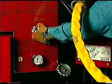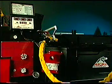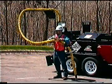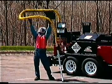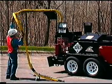Close the red and white pressure valve to its maximum to increase suction. This allows sealant to be sucked back into the tank and out of the hose. The process takes about 6 to 10 minutes for the pump to pull the material out of the line. Elevating the hose from the front to rear allows gravity to assist the pump.